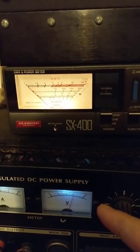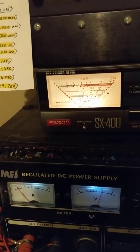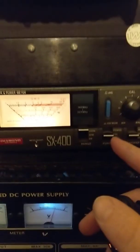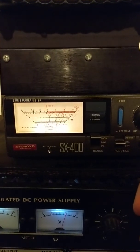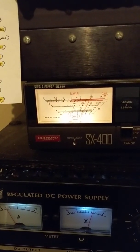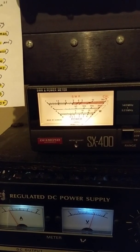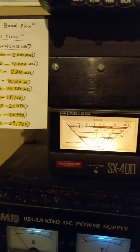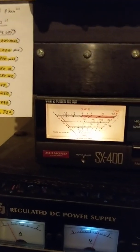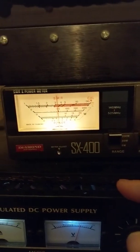I'm going to show you the SWR — I'm going to pause the video. Okay, that's still on the 50 watts, and I just flip the button to calibrate. Calibrate it right on the calibration mark right there. And then SWR — you can see it's not even a 1.5. We can go back over here to the power; it's all the way up, it's 50 watts.